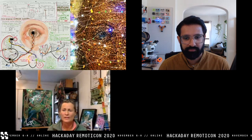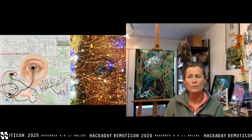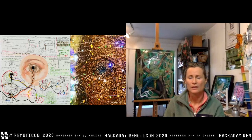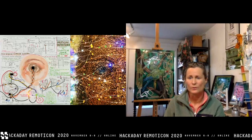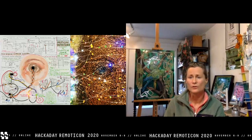That image on the right is a great example of the usefulness of what's called Thevenin's equivalent for making circuit sculpture. Thevenin's equivalent states that any combination of linear electronic devices such as resistors connected in series and parallel will function as a single device — like a single resistor. So with linear components you can make something that looks very complex but is electrically simple.